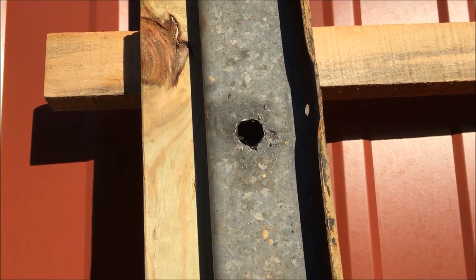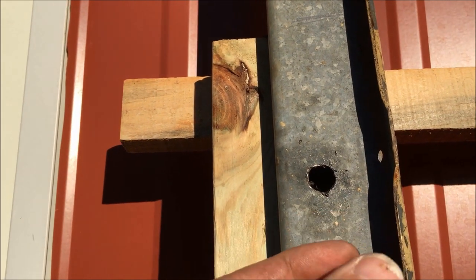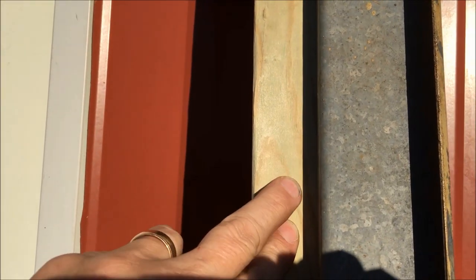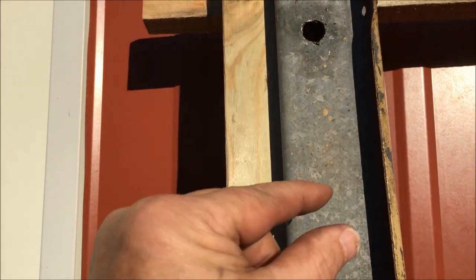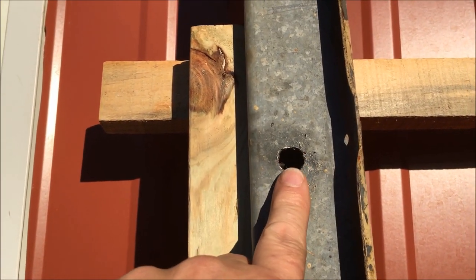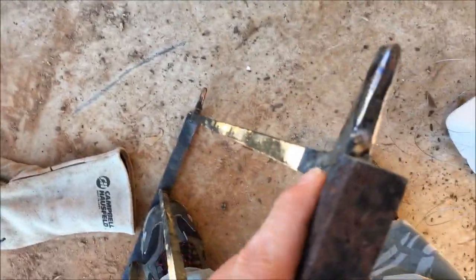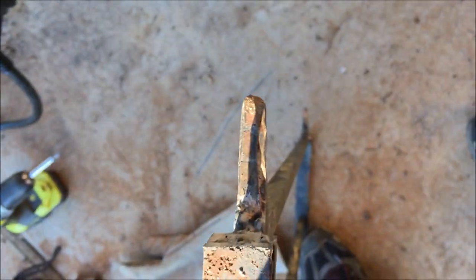What I found was when I raised the gate up and down, my drywall screw inside there was sticking out just enough — because it's not going to bury very deep in the metal, so the head of it is sticking out just a little bit because it's got a tapered head on it. And it was hanging up going up and down. So since it was hitting while sliding up and down, I tapered and rounded them — made that kind of round and also tapered them down, ground off all the welds, and just made them taper down quite a bit — all four of them — and it slides up and down like crazy now.